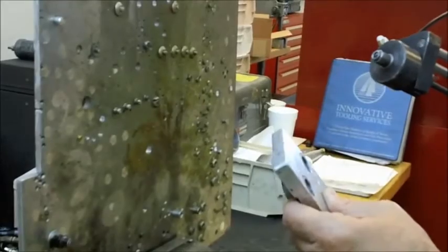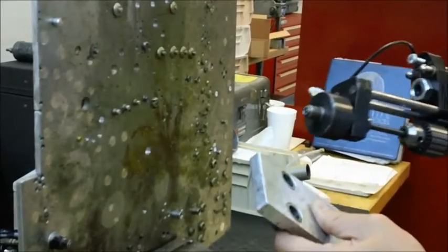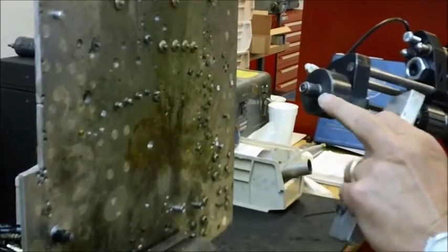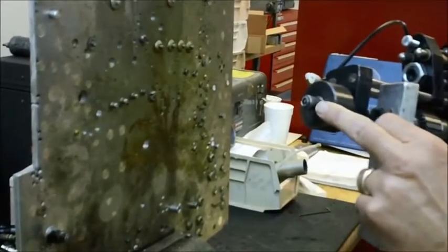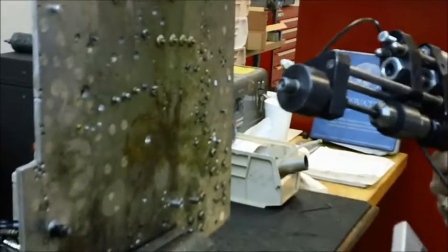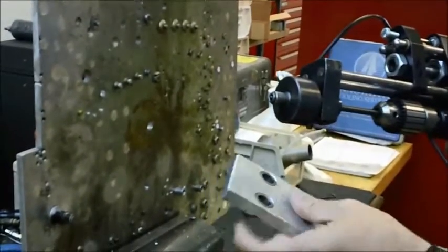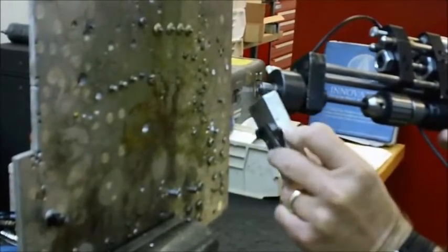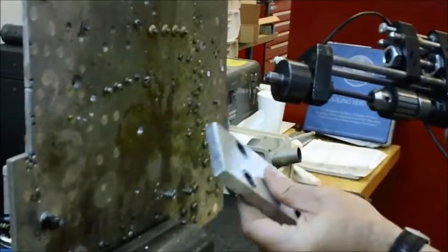This is Innovative Tooling Services TV, or Tool Video, and today we're talking about the Concentric Collet Ball Lock Powerfeed Drill. It's a patented four-ball system that works on a mandrel that shoves the balls out inside a standard steel liner plate inside the tool locating fixture here.